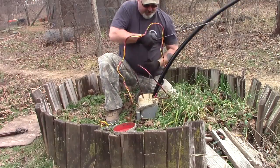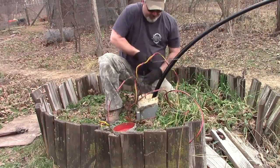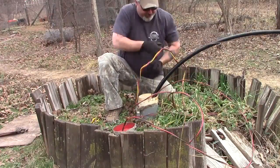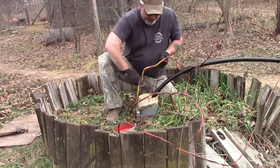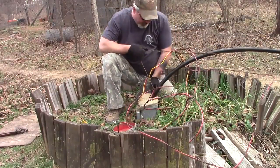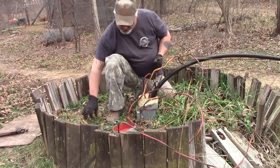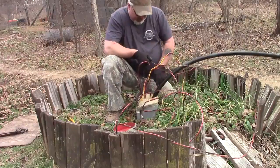As you can see I'm cutting zip ties. It should have been electrically taped before instead of using zip ties — this really created a rat's nest down in my well. Be sure to use that support rope to pull your well pump out; you don't want to use the pipe to pull it.